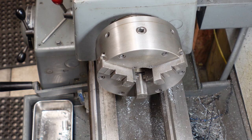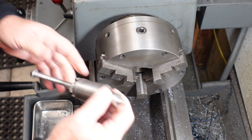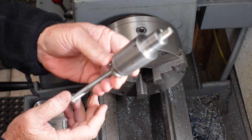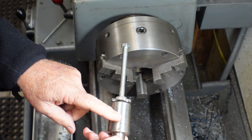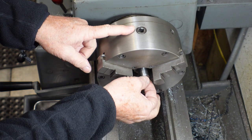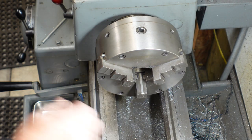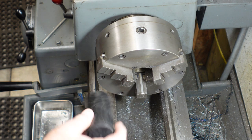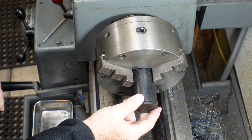Okay, we're over here at the lathe. This lathe is a Clausing 6913. So there's the fixture I made, and you can see I have the thread sticking out some. Since this is the taper that's in the back of the spindle here, just slide it in and get it to lock — which it just did with that little bit of sliding. And now I have the ability for a stop on my part.